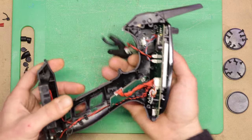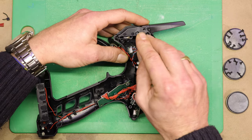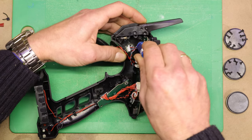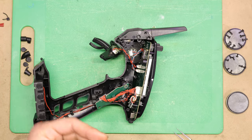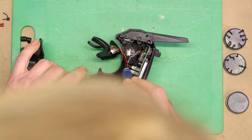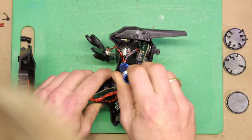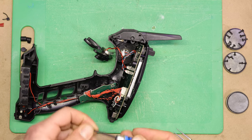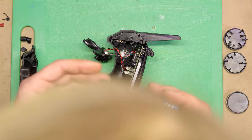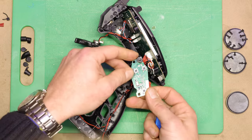All right. So now, come in. Careful not to bash your board with your screwdriver. Tighten that screw down and put in your other screws for your steering. Now, because you're going to cover these up, I'd make sure you check they're nice and tight before you put your throttle assembly in. Again, not super tight because you're going metal into plastic, but yeah, tight.